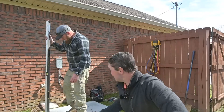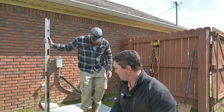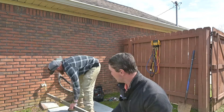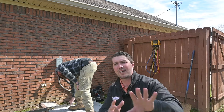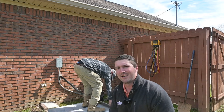Right now Dewey is installing a new pad for the customer. We determined this unit needed a new pad and he's leveling it — it's super important to keep the pad level so water can drain away from the condenser when it sweats. Then we're going to go check on Rudy in the attic.